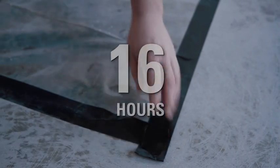If after 16 hours any condensation is found under the plastic, or if the surface is visibly darkened, it's considered too wet. Cold weather and temperature swings may affect the test, but obvious moisture always indicates a problem, and any floor paint will eventually fail.